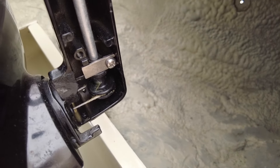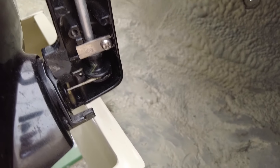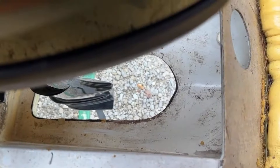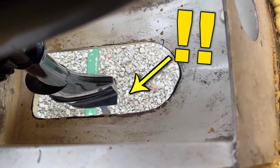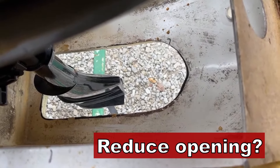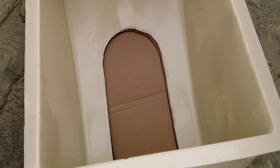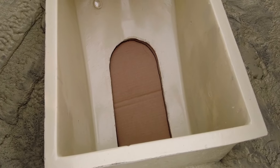I'm thinking about using fiberglass to create some fiberglass trays — like a floor inside here — that might be removable, just sitting on top, giving a nice smooth surface. In addition, there's an opening where the engine sticks through the hull and it's actually too large. It allows water to backfill inside the engine well when you're sailing or motoring. So I want to come up with some way to reduce the size of that opening, create a plug that will be tighter around the engine as it sticks through the hull. My initial idea is to come up with a pattern of the shape of the hull and make the plug slightly bigger.